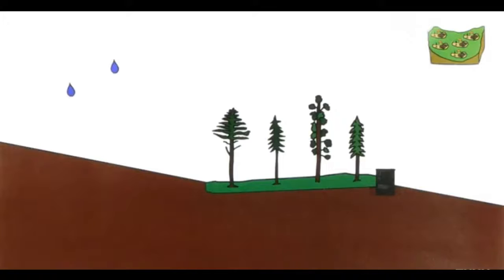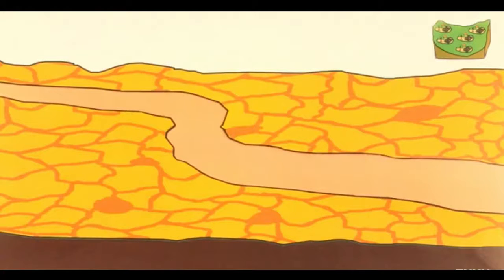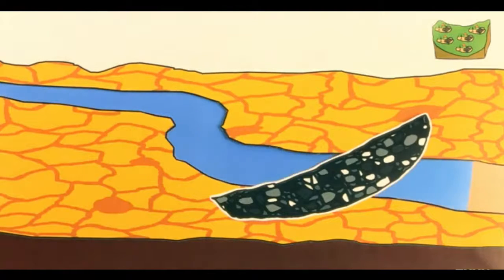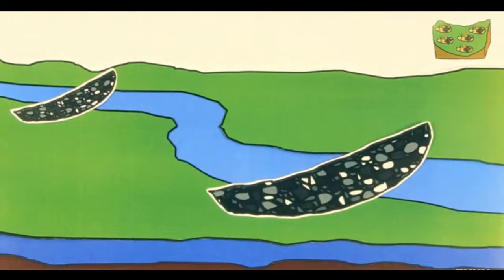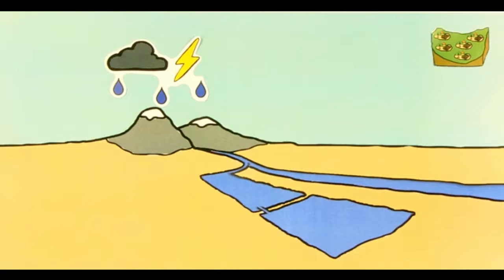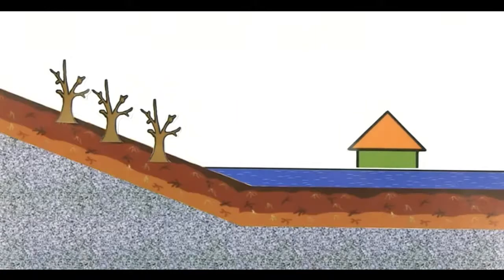In sloping systems, there are three broad categories of micro-catchments. The hillside system: water flows downhill and accumulates at barriers. The in-stream bed system: sand dams or check dams are constructed across flow channels from upstream to downstream to reduce the force of water flow, infiltrate water, and control erosion to increase infiltration capacity. Diversion systems divert water from seasonally flooded channels to larger, low-lying areas.